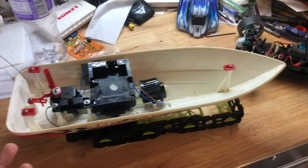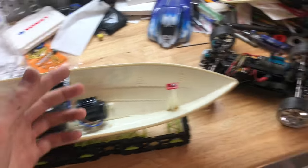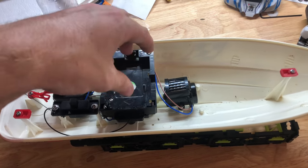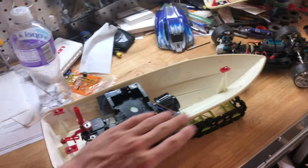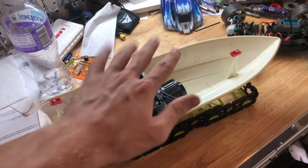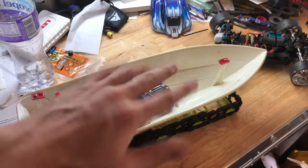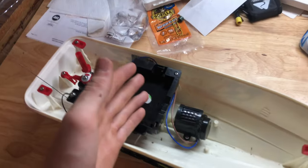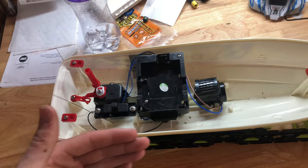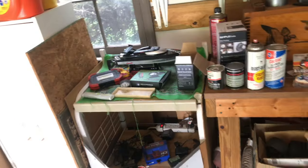Just a little fun fact — I actually did try this idea a little while ago, even before I started this YouTube channel. I put the same kind of electronics from this into this boat. The trouble is I think everything was up on top, because I put the ESC and the battery and all that right here on top. When I would drive it around it would do a lot of torque twist — not really the torque in the motor, I think, but because it was super top-heavy. The motor torque just made it worse. So this version 2 design we're going to try to eliminate that. The goal for this build isn't really power, it's more just low-speed cruising — just kind of full one way or the other and barely creeps along. I want a little bit more speed than stock but nothing crazy, because the hull really isn't designed for that.